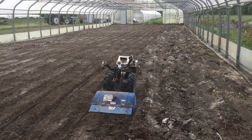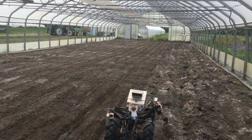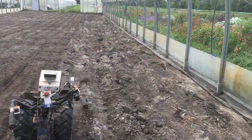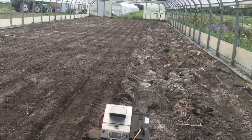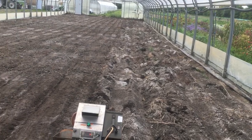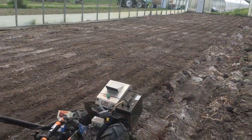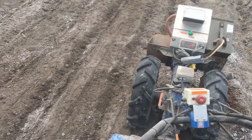Making the electric BCS work a little bit harder here. We're converting the orientation of beds in this greenhouse, so we're tilling the entire area, mixing in gypsum to correct nutrient imbalance from salinity, and some peat moss. We've gone through and ripped with a subsoiler tooth on a small tractor, and now we're tilling the entire greenhouse width with the BCS and it's holding up really well running at this speed.